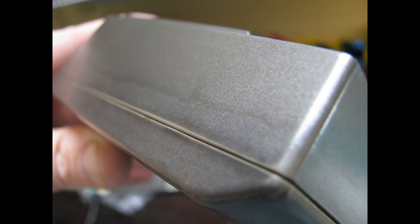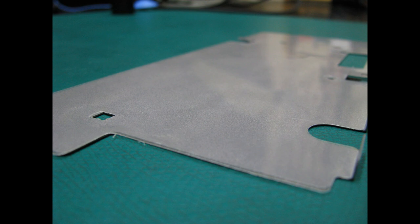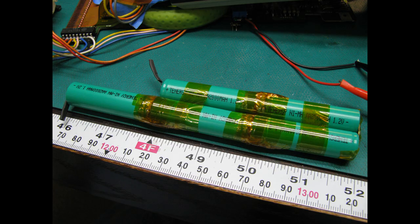I then set about to repair the damage. The case cleaned up pretty well with the magic eraser — it's not perfect, but it's much better than it was. The loose bubbling paint on the bottom of the docking plate was just scraped off since it is hidden and it will not rust. The RF shield was stripped of its plastic sheet on the PCB side, the rust was removed and it was painted, then the plastic sheet was cleaned and glued back in place with spray glue. I botched in a temporary pot to be able to test the board and it seemed to work perfectly fine. I even made a new battery pack with some tabbed nickel metal hydride cells — we'll cover this process in an upcoming video as well.